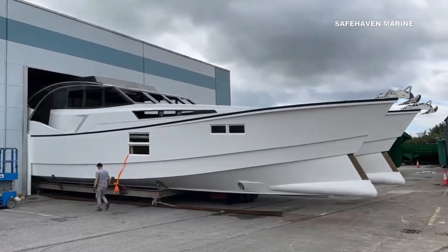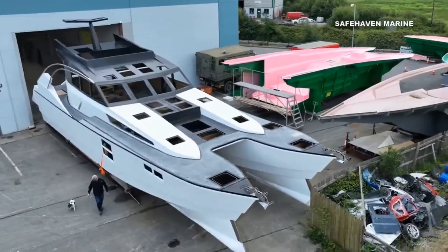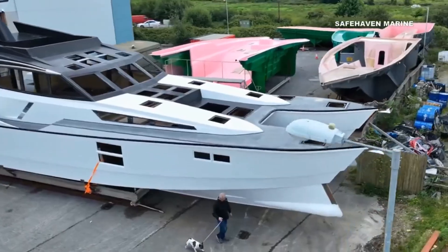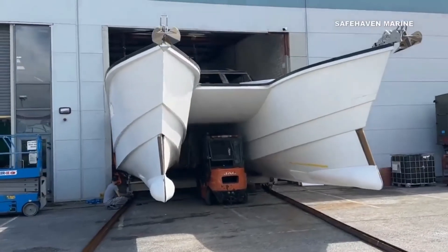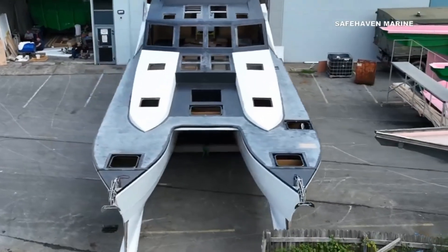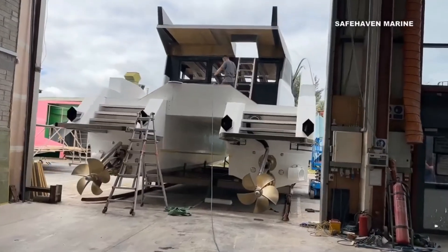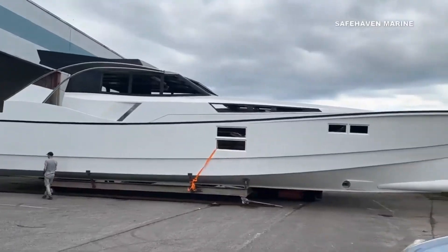The T2000 Voyager features symmetrical semi-wave piercing hulls that combine an inverted bow with traditional topside flare. The inverted bow provides a very fine waterline entry to cut through waves, but also maximizes waterline length, while the topside flare keeps the boat dry. The bridge deck is terminated some three metres from the bow to eliminate the possibility of waves slamming on it, and the bridge deck to waterline clearance is substantial, being a minimum of one metre at the transom.